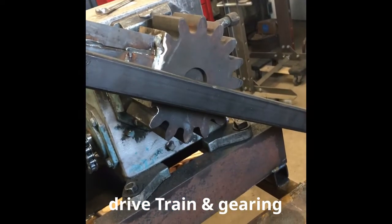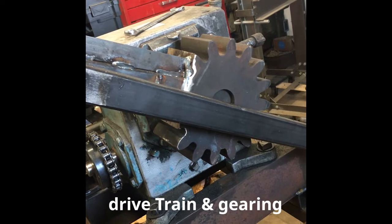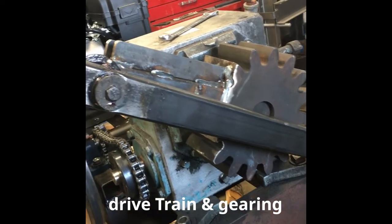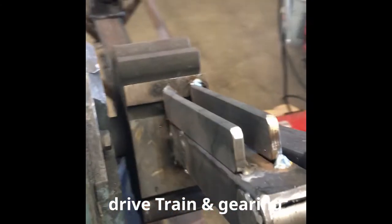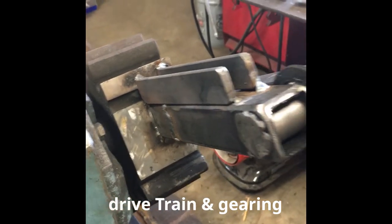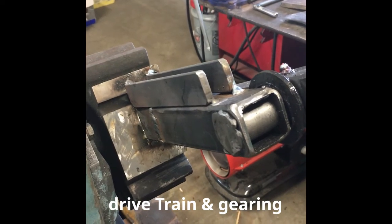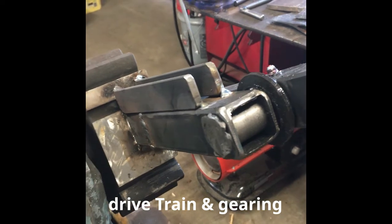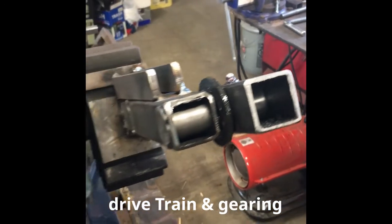This big gear that you see that the Pitman arm is attached to, I just simply couldn't get it off the shaft. It was too tough, so I just milled off the top half of it. And I welded my Pitman arm on there. Now, I broke this several times without this reinforcement, so I finally reinforced it like it is, not having any problem with any breakage.